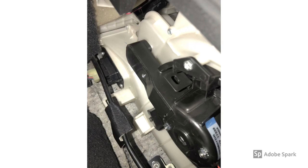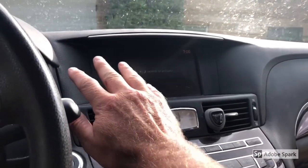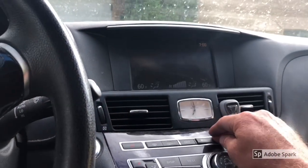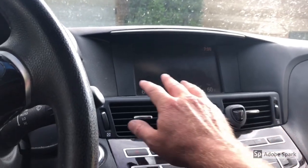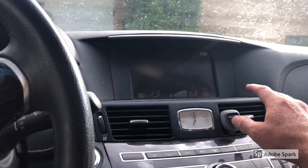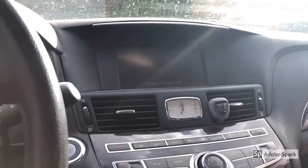Here's another look at the new blower mounted back in the manifold. Those three screws just need to be finger tight — if you over-tighten them, you will crack the case. Then just start your car and make sure you've got flow. I have the best airflow I've had since I've had the problem — walks down, walks up, perfect. That whole thing should take you about 25 minutes.